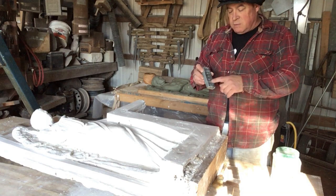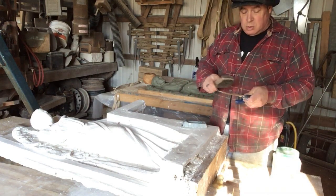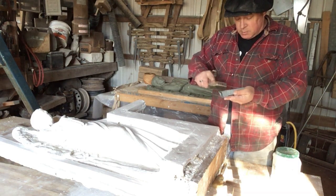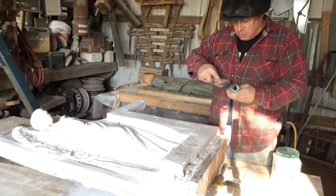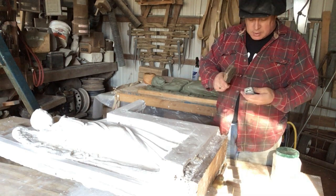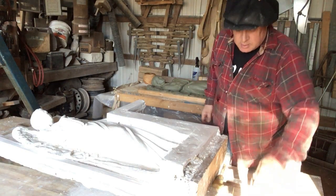Now when you do this, and you've got plaster, hydrocal, whatever, left in your tool, in your saw, I keep a brass brush to brush everything clean, because if you leave that plaster on the tool, it'll rust that edge, and it'll ruin it. Don't brush towards the teeth, brush away from the teeth or across the teeth, but try to get it all cleaned out really well before you put it up. Because if you don't, you'll leave plaster in there, and then you come back to use it, and you may have to take the blade out and clean it. But you come back and find out it's all rusted, it's junk. So get your good brass brush, really fine little brush, and it'll do well.